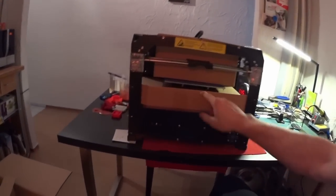I also changed some of the tape that was on the print bed because it was starting to rip, and my print bed was lined badly before so it got damaged. One thing I have to do in the future is change the firmware to a newer version, because it is running on the oldest firmware they have. I also want to add a glass plate to the printer bed so that it is more even, as it is slightly warped. But it is actually quite level, so it is very good to print with.